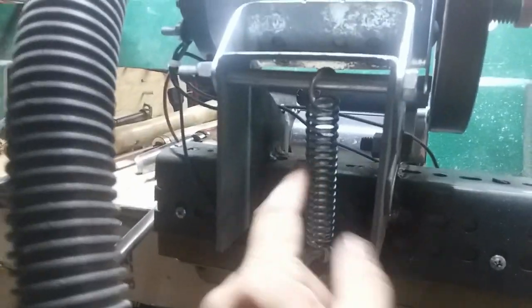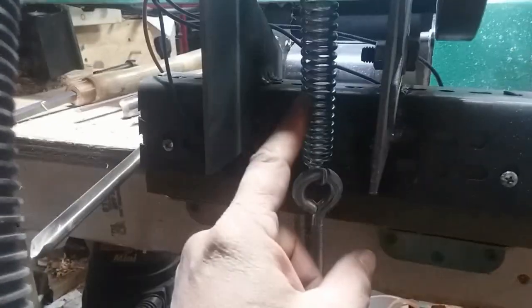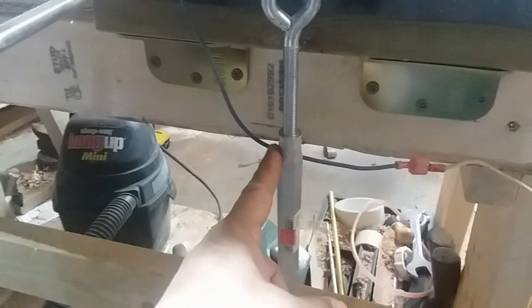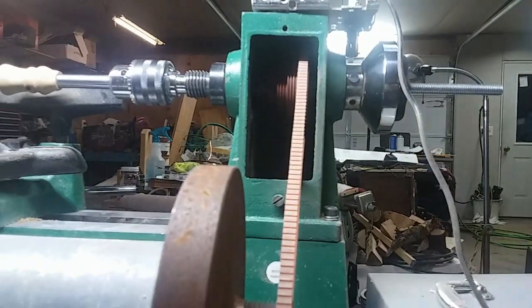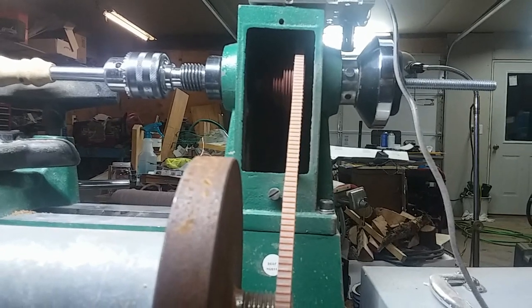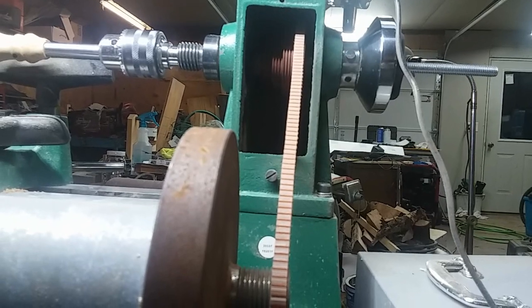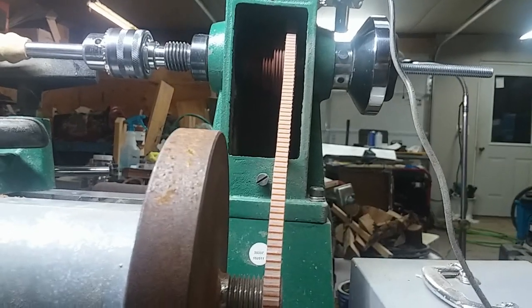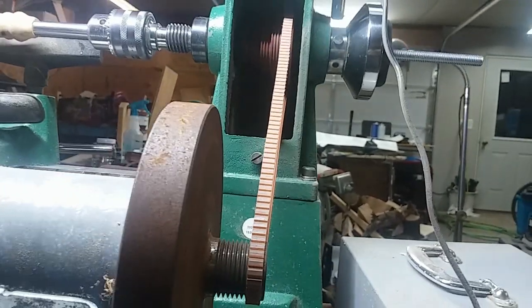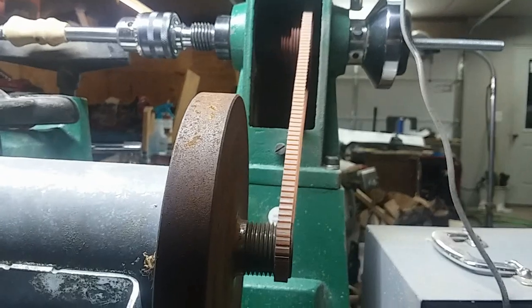I bought this tough spring right here at our local Amish hardware — that cost me two bucks — and I had the turnbuckle. That's what I use to adjust the tension on the belt. As you can see the belt is currently set up on the slowest speed setting for the lathe. If I needed more than 2800 RPM I'm certain I could get it. I really don't think I need to go any slower than the 60 RPM I got quite easily.